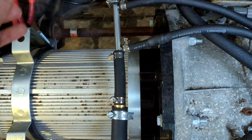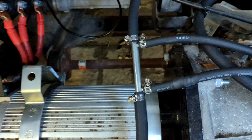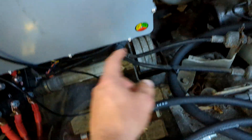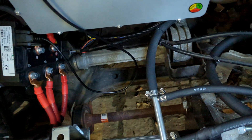Because they're in different physical locations, I had to cut the manifold — these are Zero EV coolant manifolds. Two modules, these are two connections that go to this front battery box right here. And then the rest continues with this half-inch hose all the way to the back, with the three modules that are where the gas tank was.